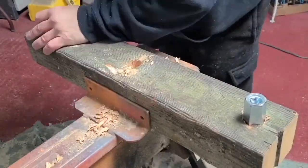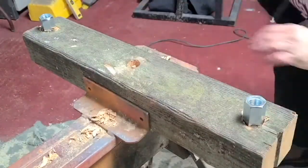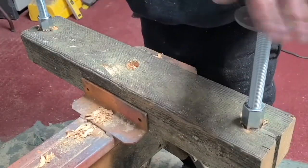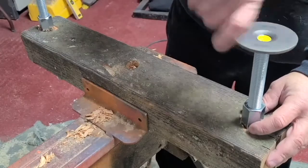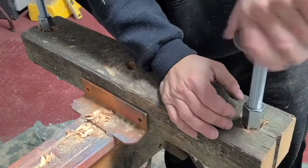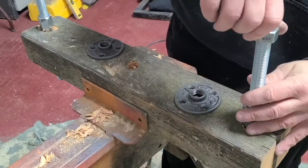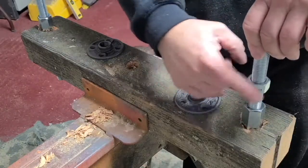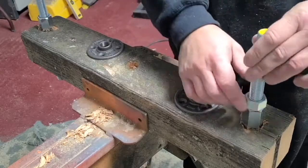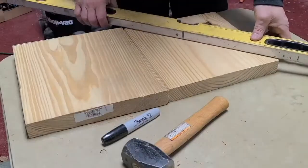When you're pounding the nut in, don't go crazy at first — go nice and slow because you need that nut to get sunk in level. If it goes in at an angle, the rod is going to be crooked. Make sure you're pounding the nut in about halfway until it's nice and snug with no movement. The purpose of the small nut is to get spun down on the long nut that's secured inside the wood. You find your desired height, spin the small nut on top of the long nut, and that locks the rod in place so it won't spin around when you're carving.